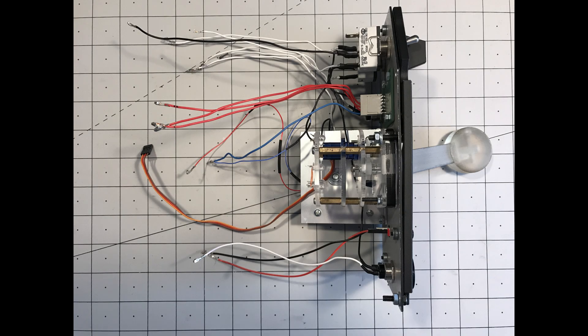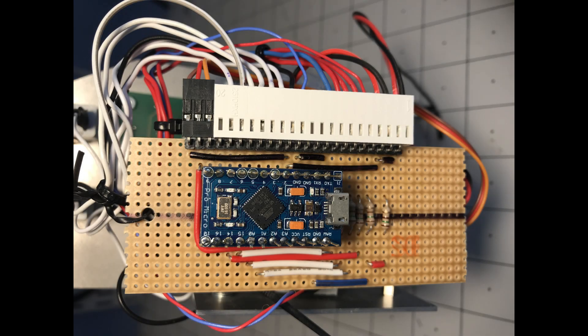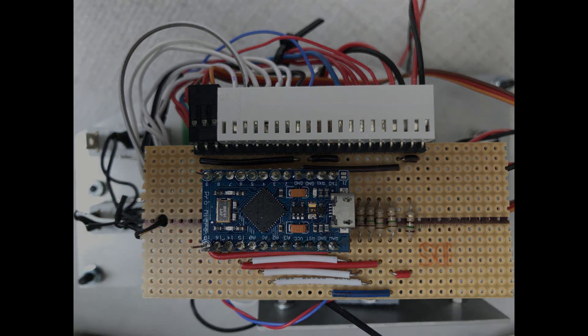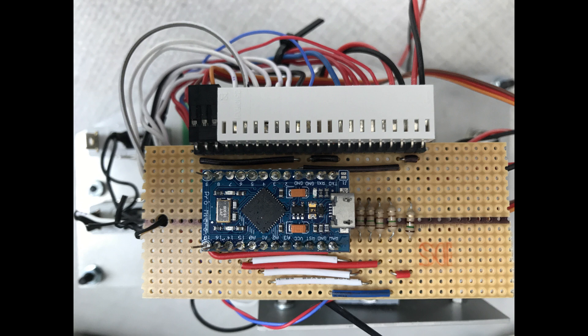I disconnected and teased out all the wires from the back of the gear panel. I made up a small circuit on a piece of strip board with the Pro Micro plugged into female headers so it can be replaced if necessary. I left the long pins on top of the Pro Micro in place for now as they're useful for testing. I tried to group the wires together into logical sections — the servo, the switches, the backlights, etc. I soldered a right-angled pin header onto the strip board to make the external connections. As much as possible I've planned the wiring to line up with the pins on one side of the Pro Micro, so the connections run straight along these strip board tracks to the input and output pins.